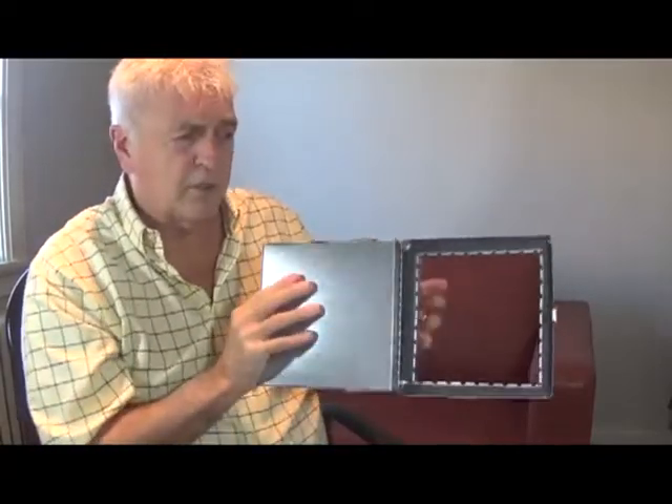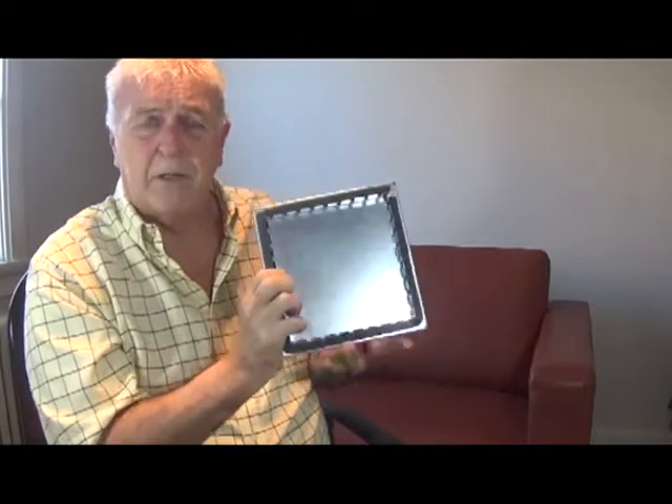It's quite a good R value. It has gasketing on the inside of the door frame so that the door is insulated and keeps the pressure in the duct when in the lock position. There's also gasketing on the exterior portion of the frame so that when the door is seated in the duct and the tabs are bent over, air won't come out through that portion of the door.